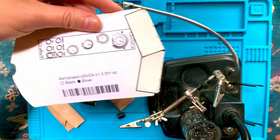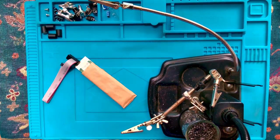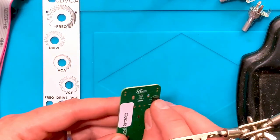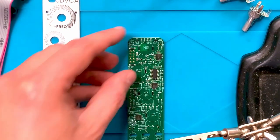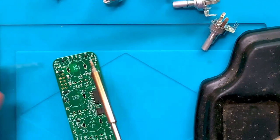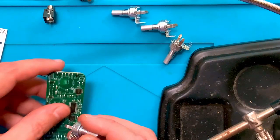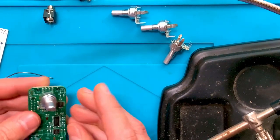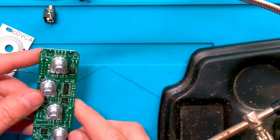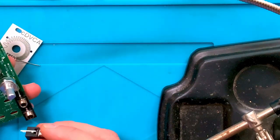Stay tuned because now I'm going to show you how to build the module and then calibrate it. Here's the kit. It's really easy to build because all of the SMD components are already pre-soldered onto the PCB, so all you have to really assemble are the panel components. Here's the PCB and the panel. I'll start with the power connector — just slip it on, prop the board up, solder a single pin, make sure it's straight, then continue with all the other ones. Now let's move on to the potentiometers — keep track of the values: one is 10K, all the others are 100K. And the jacks — all the ground lugs are facing upward.